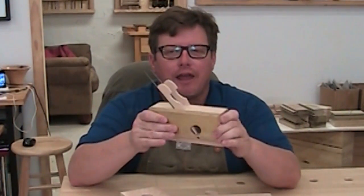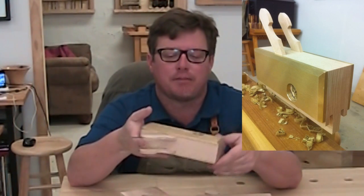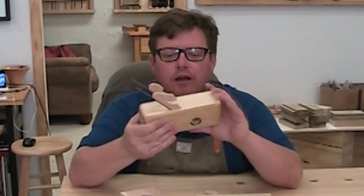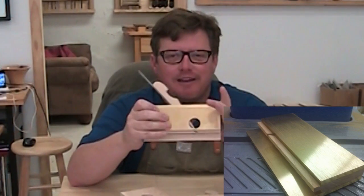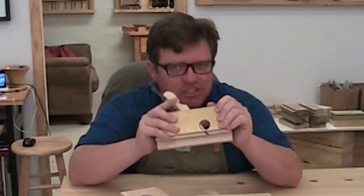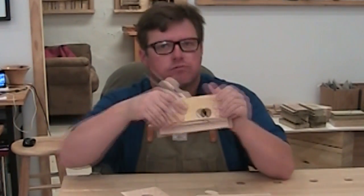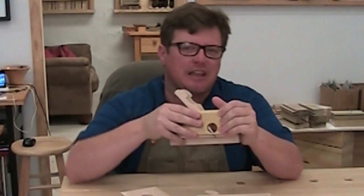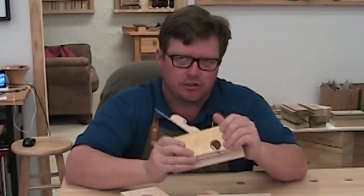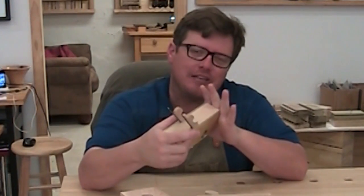I am also going to be introducing a deluxe version. This is for those of y'all that like a little plane. I guess you could call it an infill grooving plane. I'm only going to be doing it on the double, but we're going to be having the sides made out of solid brass. Screwed on, peened flat, smooth, so you can't even see it. So it's going to be a really nice one, and I would tell you, having used this for a little while, the added mass makes the job a lot easier. This is not a plane that you're using for an hour at a time. You're basically using it for 30 seconds at a time. So a little extra mass isn't that much for your muscles, but it sure does make the job easier, because once you get it moving, it flows through everything. I am really impressed at how this infill one works, and it's going to be our deluxe version.